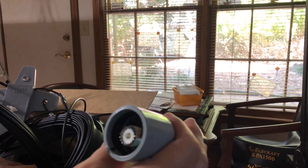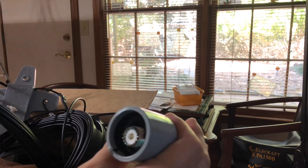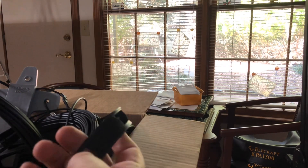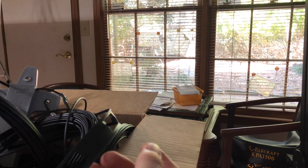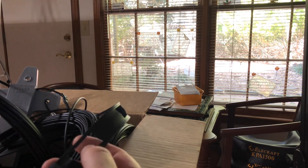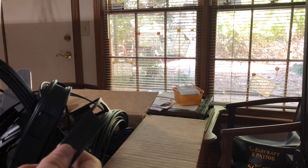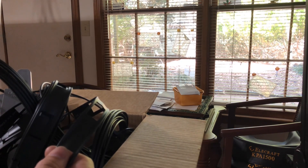What Brian Austin did was computer model that G5RV and experiment with different lengths of the window line. Some people have made G5RVs using TV twin lead — I've had one like that; it's not very robust. This is much better. When you erect it, you're going to notice a little bit of a twist in the window line. Don't try to straighten that out because that's what helps it not get caught in the wind — the wind will just kind of flow around it.